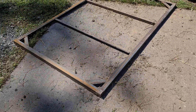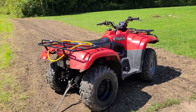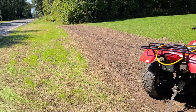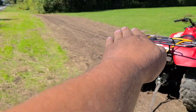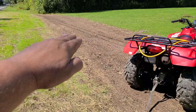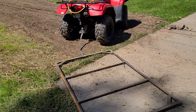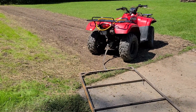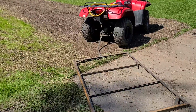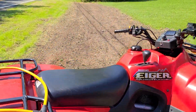This is just a random piece of steel. Lay the angle iron down, hook it up with a strap to your trusty four-wheeler — 2003 model. I took some of the high spot of the mountain here where I was getting water puddling up. I created a small swale using the excavator so the water can run across and drop into the ditches. And what I'm doing is dragging this along — it's picking up rocks and leveling out the high spots of the dirt. It's like a York rake, but it's not a York rake. It's a 'yore rake,' if you know what I'm saying.